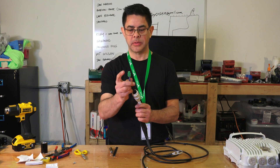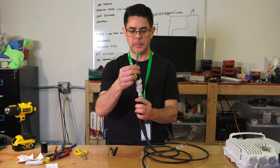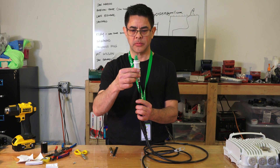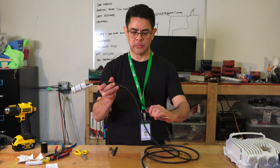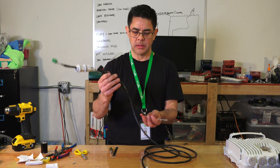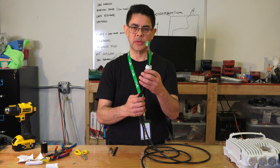We've now put the green connector on the end of the DC wire, heat shrinked it to seal the end, installed the weatherproof boot on the bottom, and got the ground strap connected into the cable system. The next step is to install this on the radio.